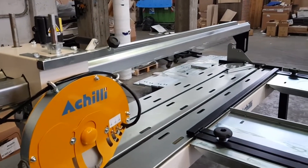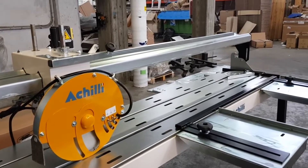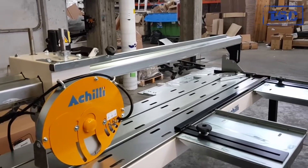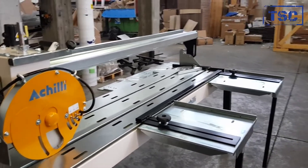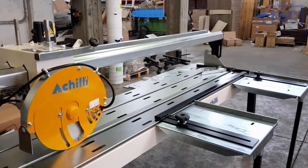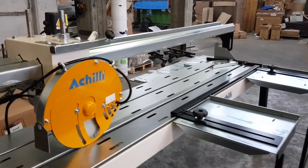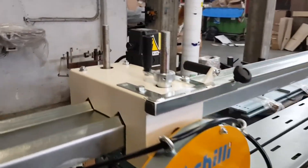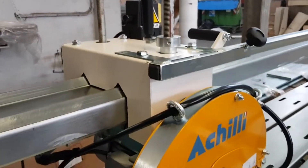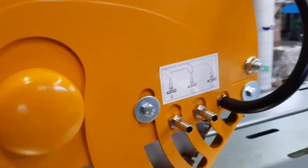The 300 or 350 mm blades are recommended for softer materials like marble and other stone of similar hardness. For those who need to cut thicker pieces, we can offer the HD version, specifically designed with higher shoulders. This version permits use of blades with diameters of 400, 450, or 500 mm with a bore size of 25.4 mm, offering a maximum cutting depth of 176 mm with a 500 mm blade. Based on the blade diameter used, the jet of cooling water has to be adjusted accordingly.